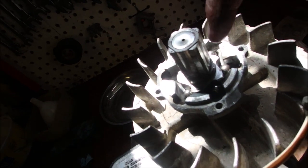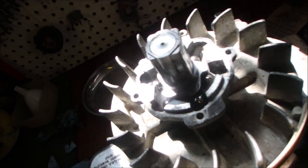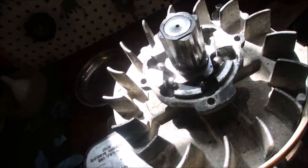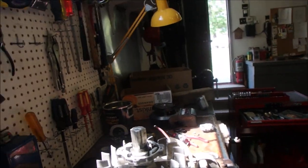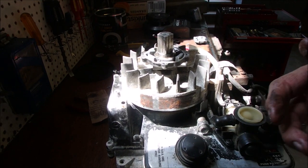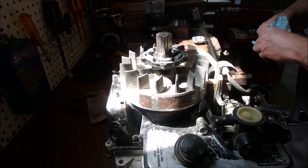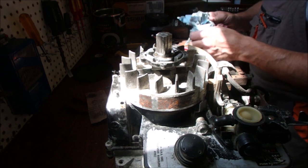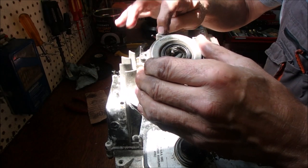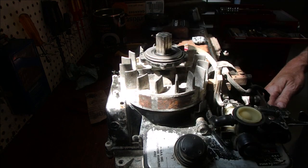I just went through a couple of these different clutches and I picked the best parts from each one. These ball bearings don't have any rust on them at all. I'm going to use this top — I know I'm right in the sunlight, I'm working at rectifying that. I'll just wipe this, and this goes on top there like that. And I've oiled the pad, and the smallest amount of oil on those ball bearings — just a film.